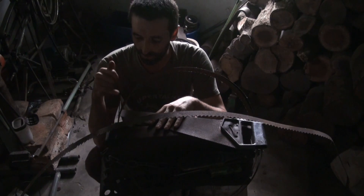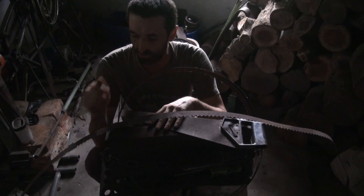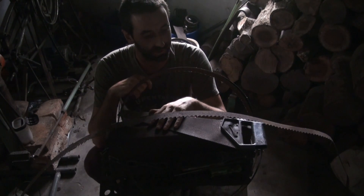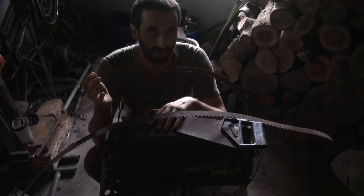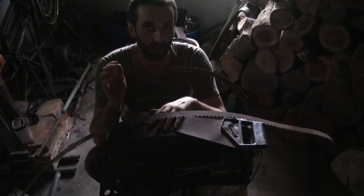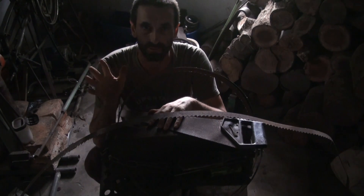So that's what we're going to do. We're going to cut a little piece of each off and then we're going to etch it, put it into the etch for the same amount of time, and then we'll be able to compare and say yes, this mystery steel is actually useful, or no, this mystery steel is a waste of time.